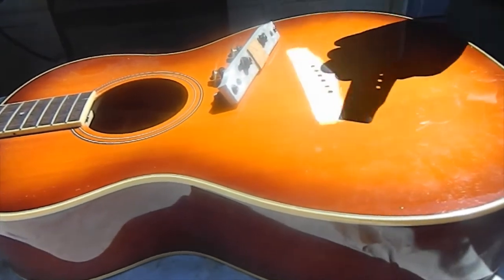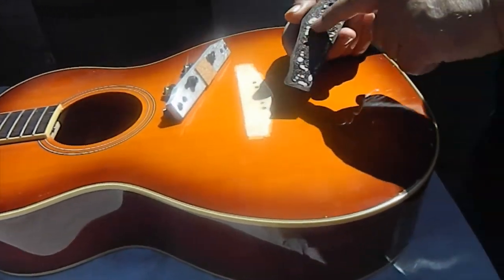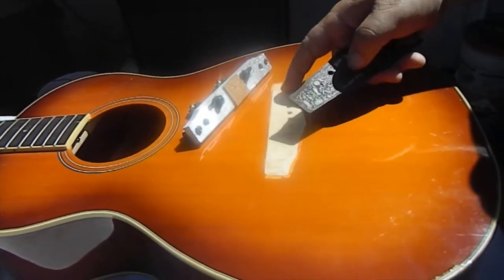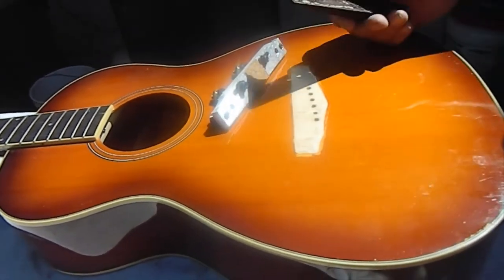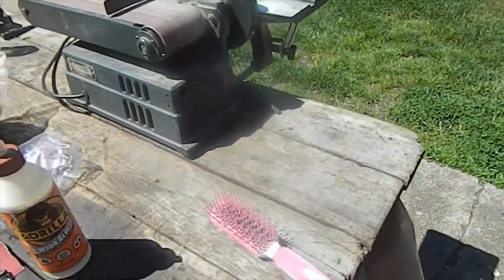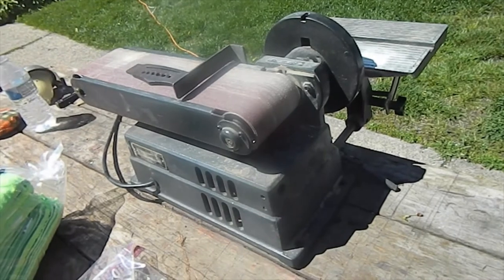Later on I'm going to show you how to deal with gluing this bridge back down onto a warped top to a straight bridge — we'll get to that during the glue-up. First thing is first: we have to clean all the glue off the top and off the bridge. It's really vital that you get all the glue off, because the new glue will not stick to old glue. We're going to clean it with naphtha when we're done to make sure there's no grease from fingers, then rough it up a little so the glue has something to bite to.